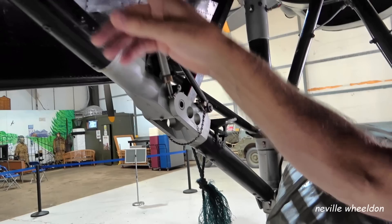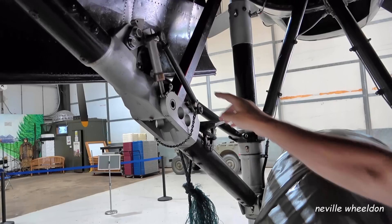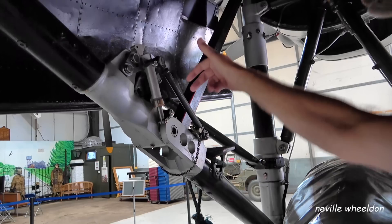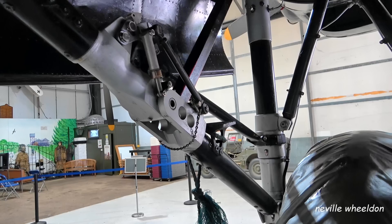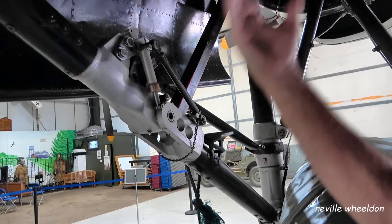Phil explains: that there is obviously the main undercarriage stay. Not all aircraft undercarriages have these stays — they give rigidity when the gear is down and locked. There's also a ground lock fitted temporarily. That little jack is just like your arm and elbow. When it moves, it breaks the geometric lock, just like locking your elbow fully and pushing back on itself makes your arm go rigid.